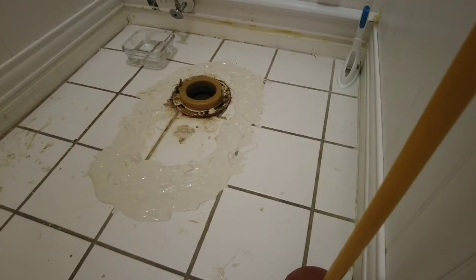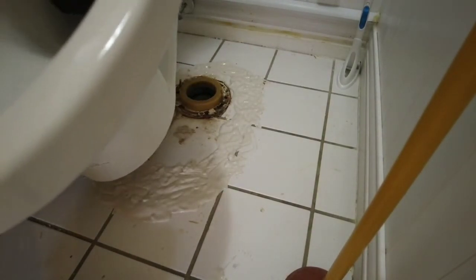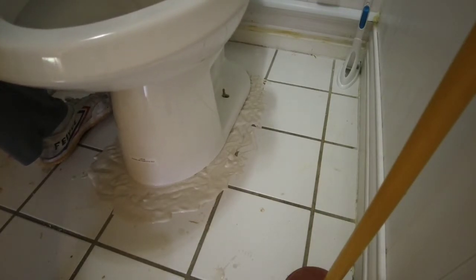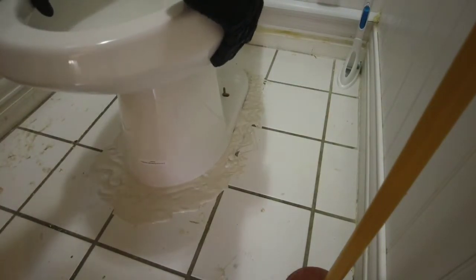Now I'm just going to bring the bowl and see how close we are. Once again, when you're transporting the bowl, do it by your hand inside the trap seal. Okay. And people put a lot of plaster around the ring also, and that's not necessary. Like I said, that's not what it's there for. Now you do want to be a little careful when you're putting this down, because you don't want to press down right on top of the flange bolts. Okay. Okey-dokey.